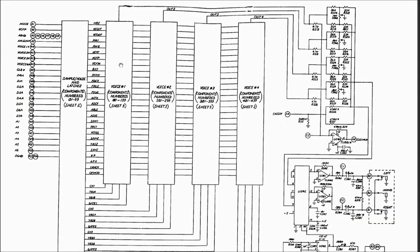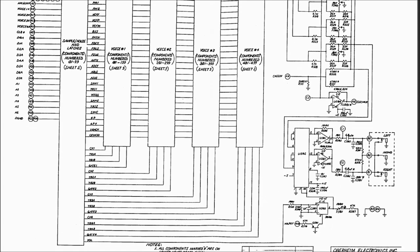Each voice board has four voices on it, and there are two voice boards in the synthesizer. This OSC-MUX signal is where the auto-tune picks up the voice card output, so we know our signal's making it at least this far. On each voice board, there's a CEM3360 used as a final VCA and a dual op-amp for the left and right channels.